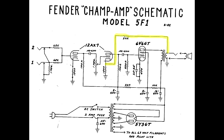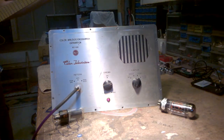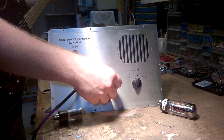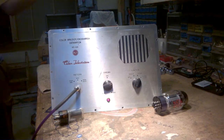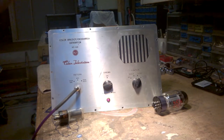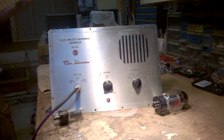In this circuit there's a fixed resistor controlling negative feedback. You can completely omit that resistor — some amps do that. The Fender Vibrolux Reverb has no negative feedback circuit in it, and I've modded several of those amps to have one or have a variable one. As you change your resistance in that part of the circuit, you'll get more headroom one way and more compression the other.